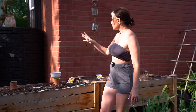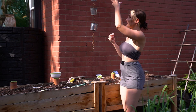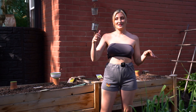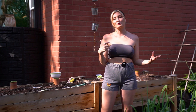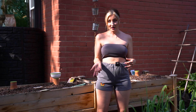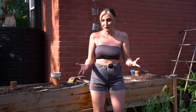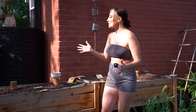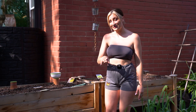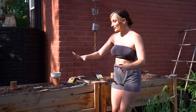There used to be a rain barrel right here and the rain chain is still here — it's going to be leaving. We're going to be redirecting the spout so that the brick stays drier. I was noticing there was a little bit of water retention in the brick of my house, and that's very bad — over time it can destroy the brick. So we got the water barrel away from that and put it closer to the sun room, more elevated, which allows the water to flow better. We've cleared out this whole area.